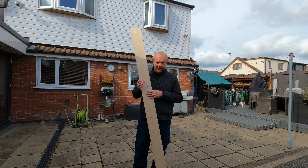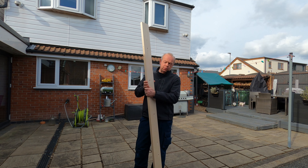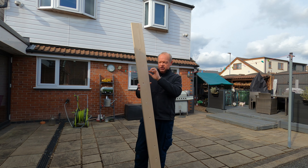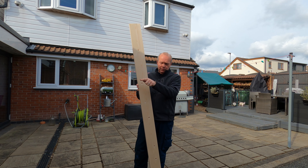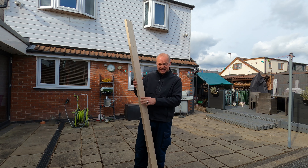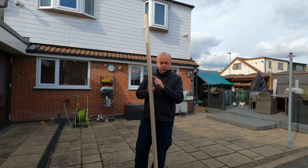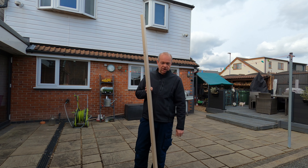This is the piece of wood I just bought. It's probably a bit thicker than it needs to be, but that will allow me to put some grooves in it so that when I sit it on the table saw, the two arms that extend the table will be completely sunk in. I have to be careful of the rail guides at either end. It's 131mm by about 2.8cm, so the first thing I'm going to do is cut it down to size.